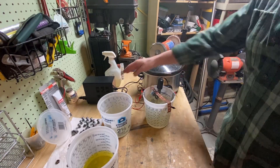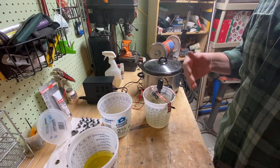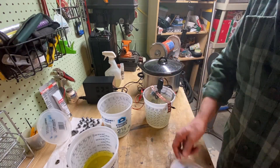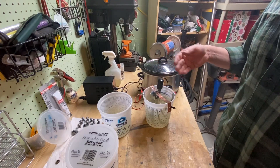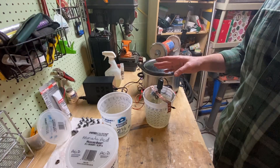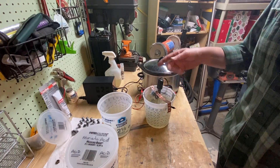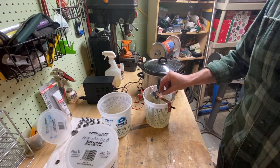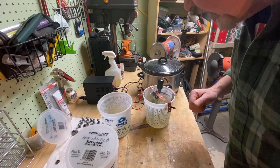While this is in there, let's talk about the power supply. I've done this before using just an old phone charger, an old wall plug-in — anything capable of supplying about an amp. You can do it with a couple of D-cell batteries as well. There's a formula to figure out per surface area how much current you really need. If you go to the Caswell Plating site, that calculator is available. If I remember right, the math is: per square inch you need about 0.142 amps. The voltage doesn't matter — it's the current that's being drawn. We've been in there for about two minutes and the plating process is doing its thing.